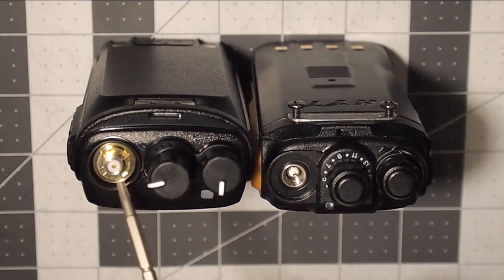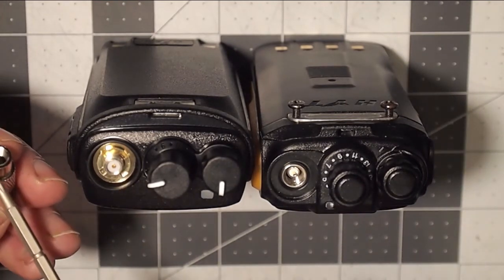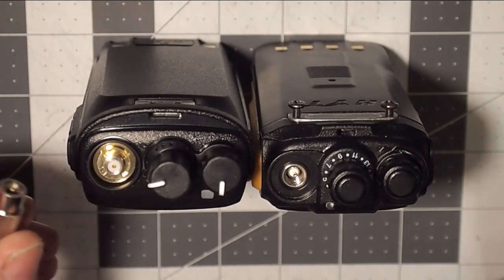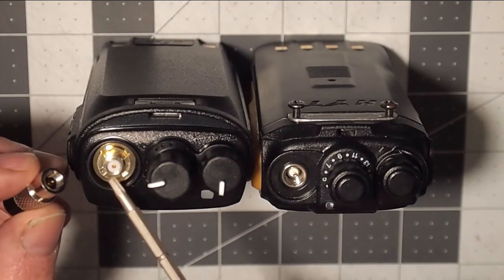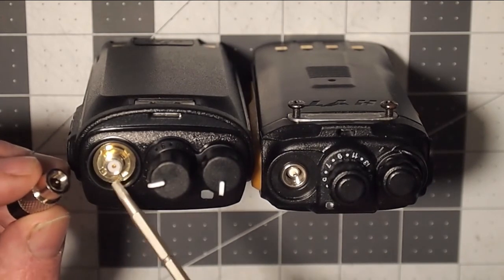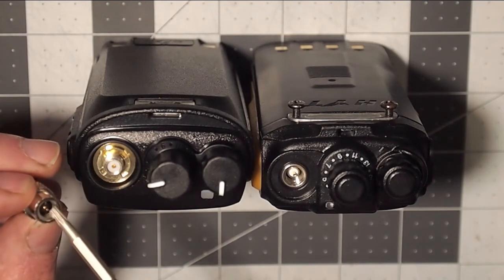You can see here on this one the pin fits inside the recess. So although the sleeve goes over top — which if it were based upon the sleeve connection, that would of course be female — you don't base it on the sleeve, you base it again on the pin.